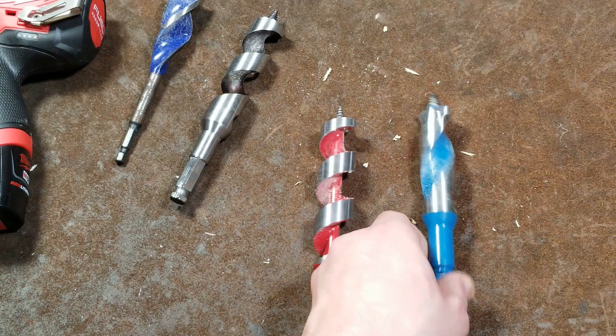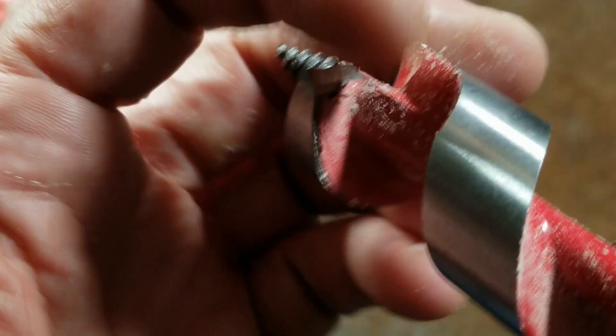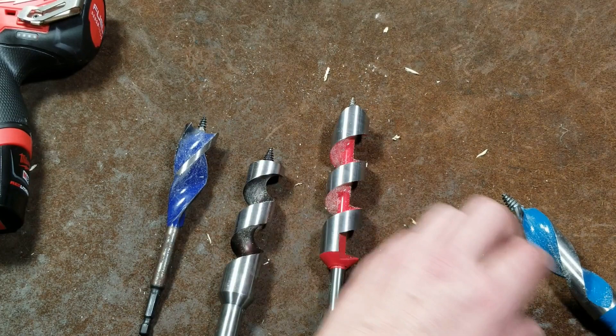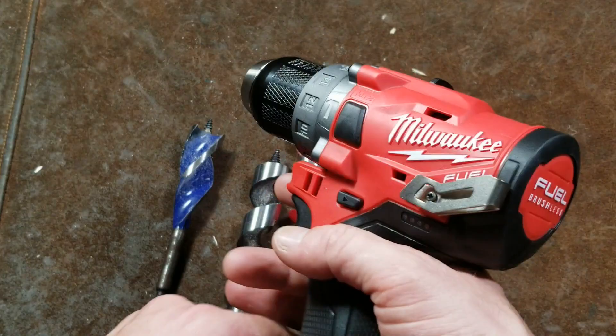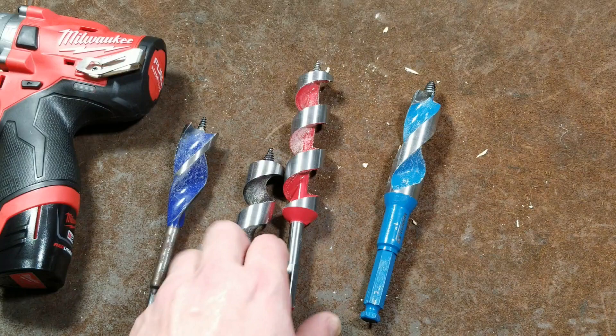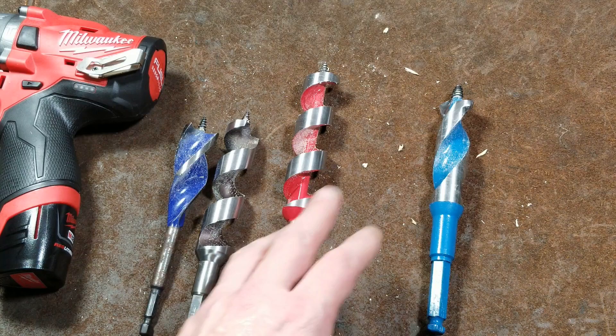The Hercules is a straight-up do not buy until they fix the grind — who wants to buy a bit they have to resharpen out of the box? The coating appears relatively heavy duty but doesn't seem quite as thick as the Bauer's, which has a real thick coating. The Hercules was the hardest wood auger bit I've ever used, requiring both hands and nearly torquing out of your grip on an M12 Fuel brushless. No thank you. I appreciate everyone watching and subscribing — if you haven't subscribed, please do. Until next time, Cadis Maximus out.